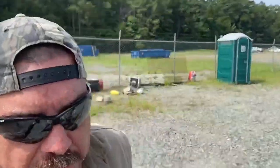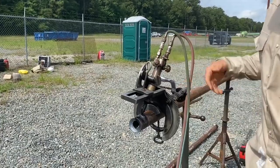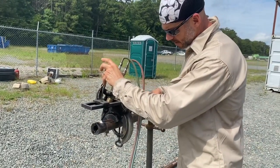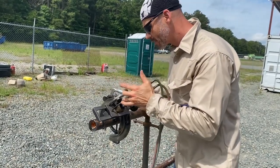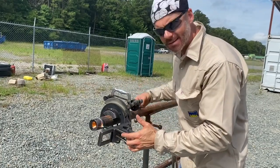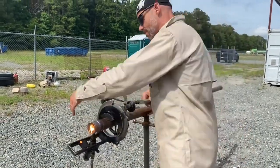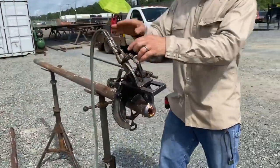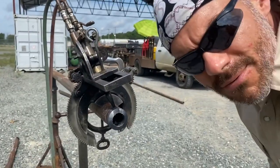That's why we start one way, get a good clean bevel, and while that slag's hot you run back through it. If you start over here and then run back through that old slag, it won't stop you. That's a slick bevel — great.